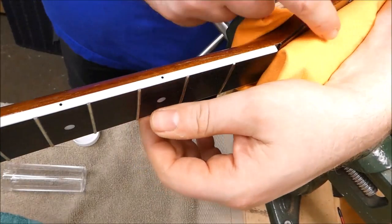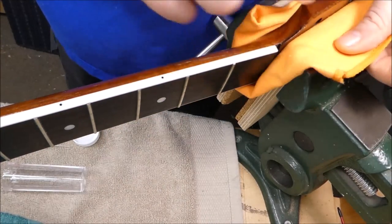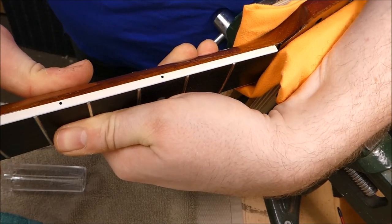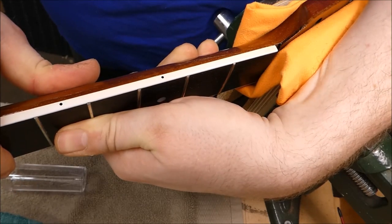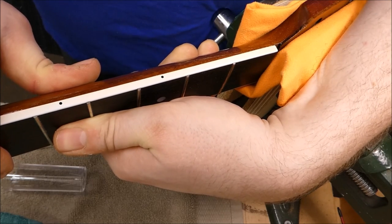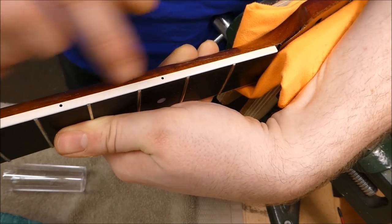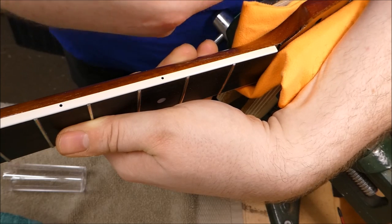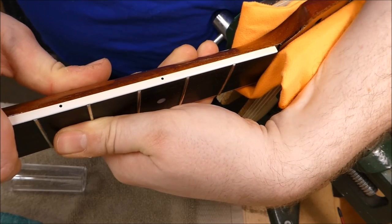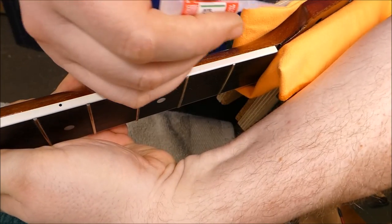I've taken the tuners off and put the headstock in my vise here — it's got cork padded plywood jaws so it's not going to damage the headstock. I'm trying to get enough leverage to separate the neck from the fingerboard in that area. I can get a little bit of movement, but it's not big enough that I could get a syringe in there with standard woodworking glue. It's interesting — the effects of string tension will actually close this crack rather than open it up, so it's going to be well supported. I'll rely on capillary action to get that in there as far as we can.